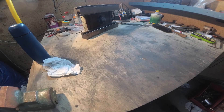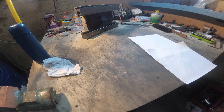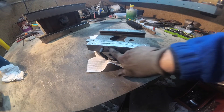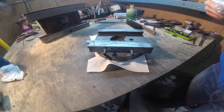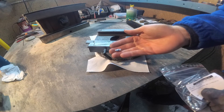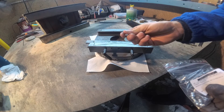Okay, I have taken out the headstock saddle because I want to tap one hole for oilers. This is this part, and I need to tap this hole. I wasn't able to tap it before because I didn't have the oilers yet. But now they are here.